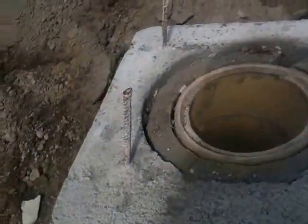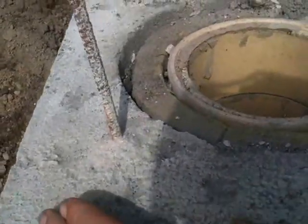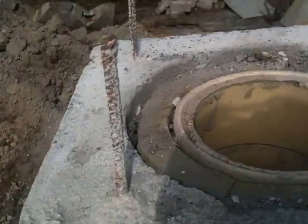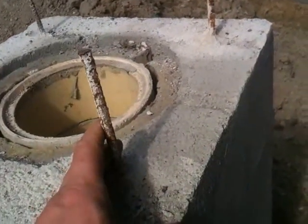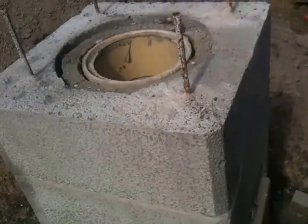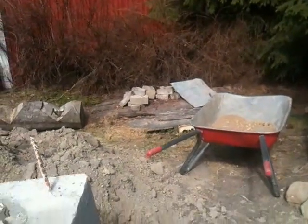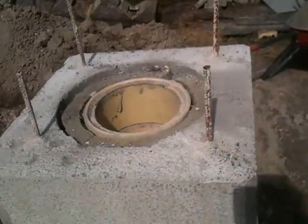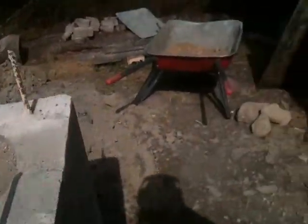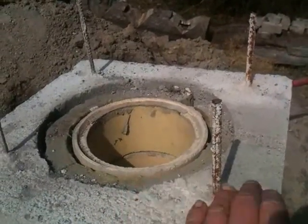Okay, not perfect, but as I thought might happen, the line I was cutting was only 4cm above this seam, and as it all came off it just broke down. So I cut down to the seam itself. I'm going to have to cut these off, and now I am about 4cm too short. Most likely I'll cut some pieces of brick in half to get 4cm and put blocks underneath the bottom. I'll move this into place and then I'll have an exact measurement of the height — whether to put blocks underneath or build on 4cm of concrete onto the top.